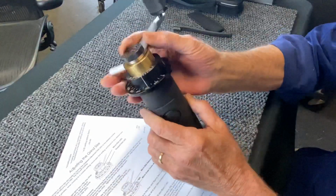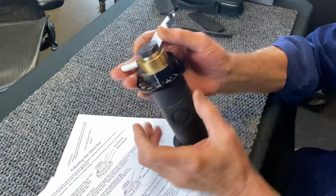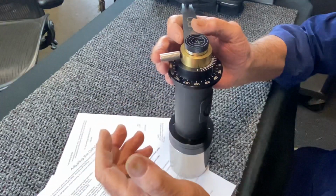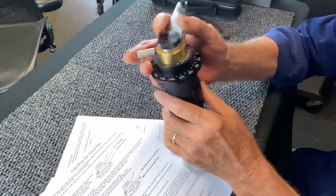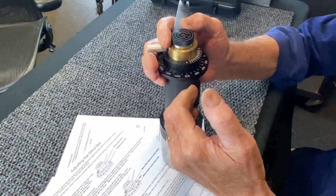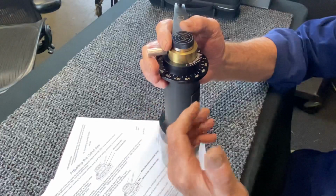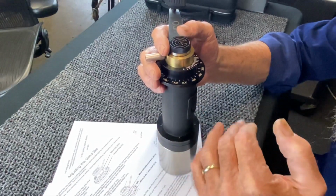And one thing is that if you move it in the coarse direction over and over and over, the brass disc will hit the handle. And if you move it in the fine direction too far, 100, 150 microns in that direction, you run out of threads in the system. So there's physical reasons why we want to do this, but a lot of it has to do with keeping your numbers relevant, to maintain meaningfulness in the numbers, so you can actually say, I'm grinding at X vertical burr movement, and know you mean it.